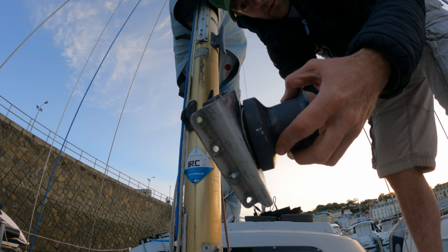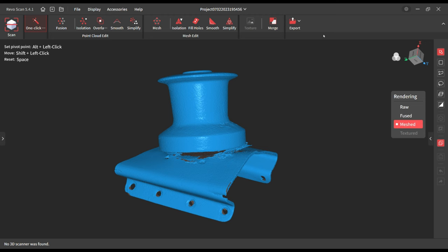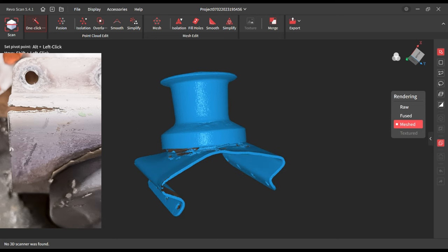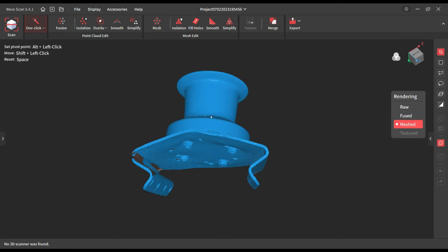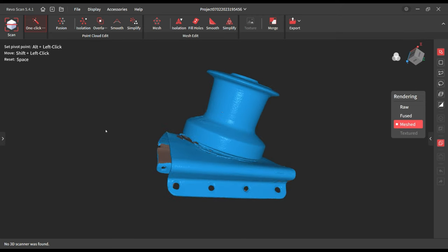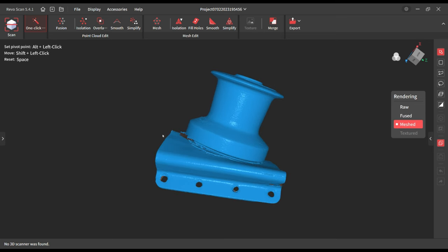As you can see from this, the winch plate has kind of heavily deformed in the direction of the load. It's both pulled away from the mast at the top and compressed in towards the mast at the bottom. It's obviously been subjected to this probably over the 50-year life of the boat. We can see these cracks have formed and propagated down the curved edges of the bracket, and they're just opening up with every time it's loaded up. You can just get a real sense from the 3D scan of how that plate is deformed.